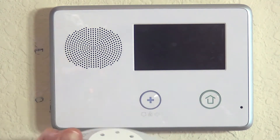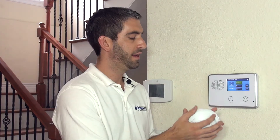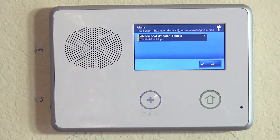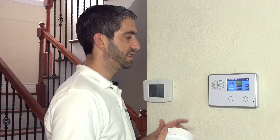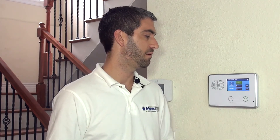When doing heat testing, you can use a blow dryer to have the rate of rise heat sensor go off, or for an easier test just to make sure the wireless transmission worked, we can tamper the device — pop the head from the base — and you can see 'kitchen heat detector tamper.' So we know that twisting this activated the tamper. As soon as you close the tamper, it cleared the message, and now we know that our Honeywell 5809 heat detector was properly programmed to our 2GIG GoControl panel. We hope you've enjoyed this video and invite you to subscribe to our channel. If you have any questions on using your 5809 or programming it to your 2GIG GoControl panel, please let us know by emailing support at alarmgrid.com.